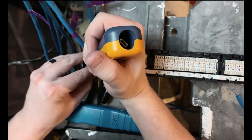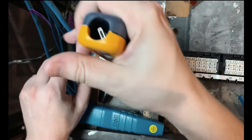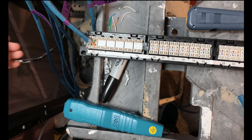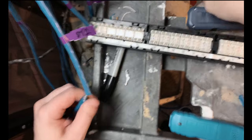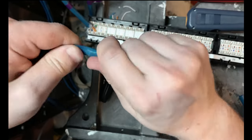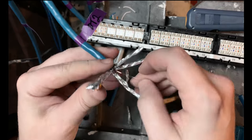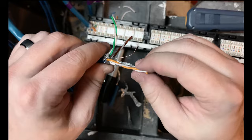Just to go back — this is again my least favorite thing in networking to do, hence why it took me so long. It's just so tedious, especially if you're using Cat 8 where you have to peel back all of the different shields. There's the end product — all of them punched down like they should be. Completely tedious. You can see I'm going in doing the other cable now — desktop port number two — going through the exact same process: removing the outside sleeve, getting rid of all the shielding, unshielding each individual pair, and punching it down.